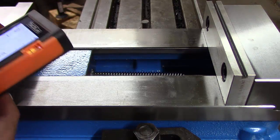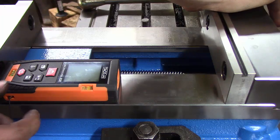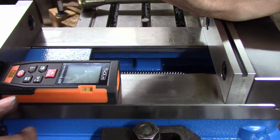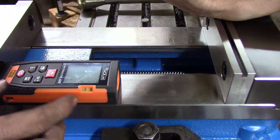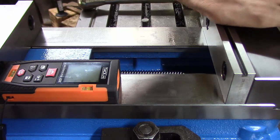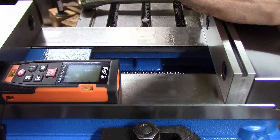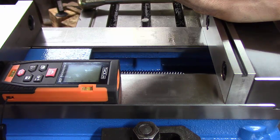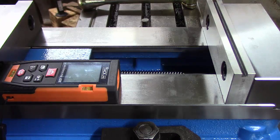I've been sitting here for the last half hour trying to figure out how to calibrate this thing and I ain't figured it out yet. But looking at the plus-or-minus two-millimeter spec, if you do the math that's like 79 thousandths. You can easily see 40 thou, so I don't know — it ain't looking too good, especially on a short run. A long run you can differ a little bit, but a short run it ought to be a lot more accurate. Moving on, we'll take a long measurement and see if it's any better.